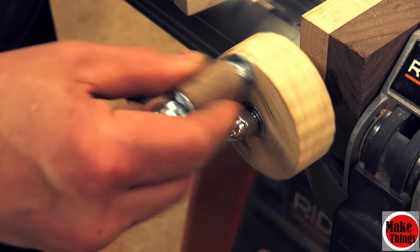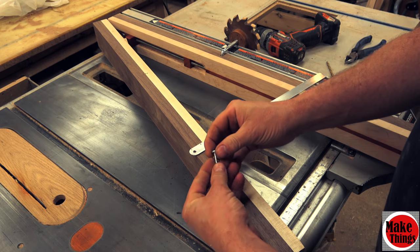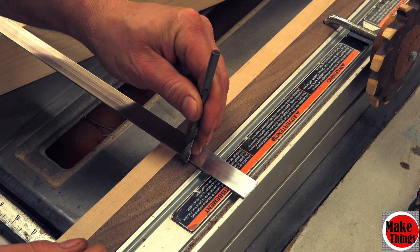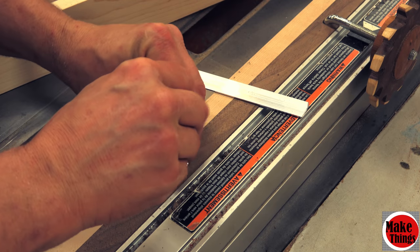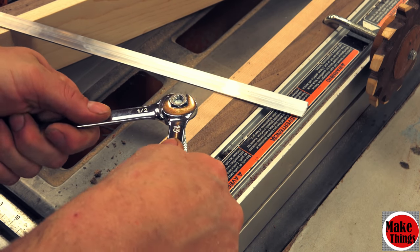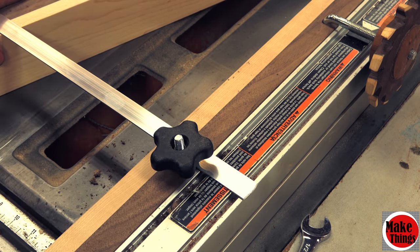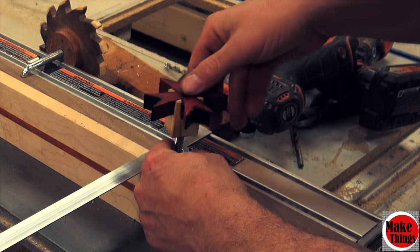If you're wondering why I didn't use a larger wheel, I didn't want it to interfere with the table saw fence lock. One final thing we'll add is a safety bar made out of aluminum. This will give the jig a little bit of safety as well as a way to lock it all together. I drilled out a hole big enough for a number 12 pan wood screw on the pivot end. The opposite end I drilled out a hole for a 5/16th inch hanger bolt. A good tip is to jam nuts on the top before trying to insert this. I tightened it up before removing the nuts and adding an external tooth lock washer, washer, and then a knob. This really does a good job of stiffening the jig up. I made my own knob — the construction of that knob will also be in the description and will be a part of the crank video.